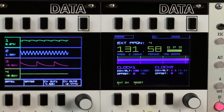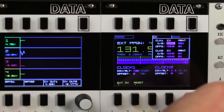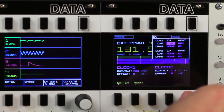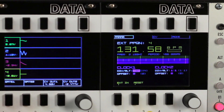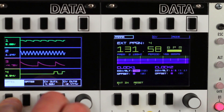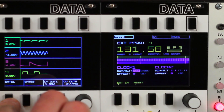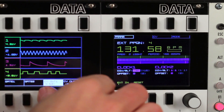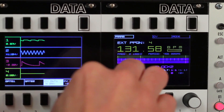In this next demo, we add clock 2, which is triggering a VCA that passes a Dixie square wave. The Dixie's pitch control is modulated by a Data oscillator acting as an LFO — a clipped saw wave that you see on the voltage monitor screen, channel 1 in green. Adding CV control to clock 1, CV channel 3 is a Maths envelope which you can see on the voltage monitor channel 3 in red. The incoming CV is working off the DivMult setting of times 32, with the final clock resolution value in gray next to the times 32 value — it's changing along with the rising envelope. Now let's use the gate output of the voltage monitor program to turn on and off an Audio Damage A-Verb on the main audio track. This gate is also being monitored for display on the display's channel 4 track. The two CV outputs are connected to the Mad Hatter's crossfade and high-pass filter CV inputs.